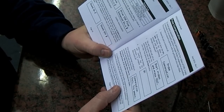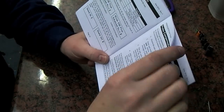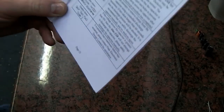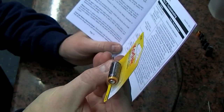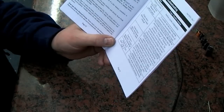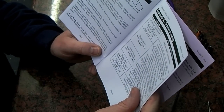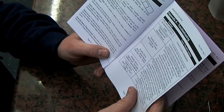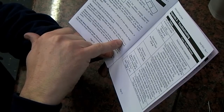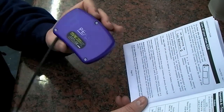It's suggested you use a fixed 1-ohm resistor to verify the correct ESR reading — I've already done that, so that's not an issue. The meter uses a small 12-volt battery — a readily available type. Battery types include 23A, V23A, GP23A, and MN21. There is a low battery warning on the meter, and once it hits that low battery level it will turn itself off. Battery access is by removing the back cover.